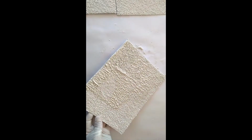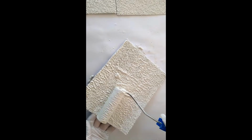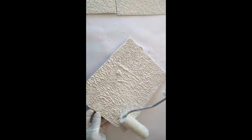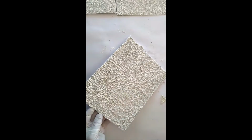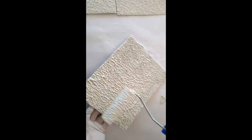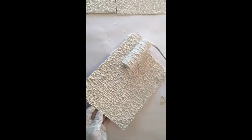Once applied to all the plates, they are placed in a shaded place but with a current of air. For 2 days and 4 times a day you have to moisten the plates just finished. This is necessary for the curing of the spongy cement applied. In the kit a nebulizer bottle has been included to do this, and for when we have to do performance demonstrations. This nebulizer bottle will also be useful to moisten our plates before putting them in the sun.